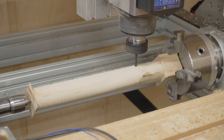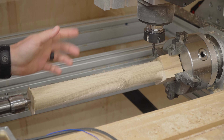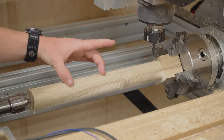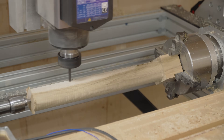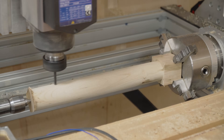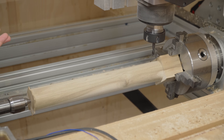I'm going to load up another cut to go just a tiny amount more and see if we can clean this surface up. Still kind of a rough surface, but of course this is routing perpendicular to the grain. For further experimentation I'm going to go down just a little bit more and change my raster cut from along the Y direction to along the X direction. Now the A axis — the rotary — should travel the least amount and we should be going back and forth along the X as it incrementally moves with every single pass. That should result in a much smoother surface because we're going with the grain. As expected, that's the better surface finish — definitely smoother going in the X direction.